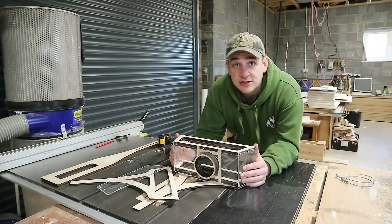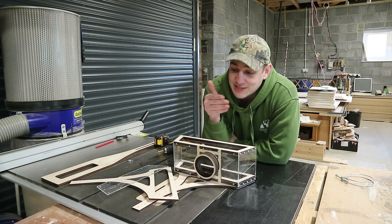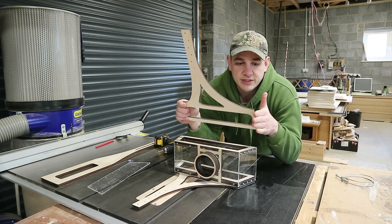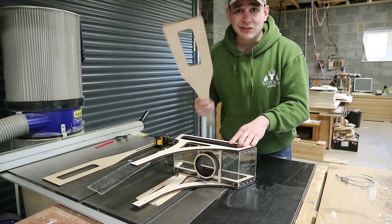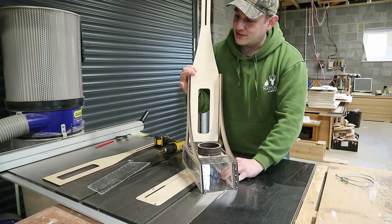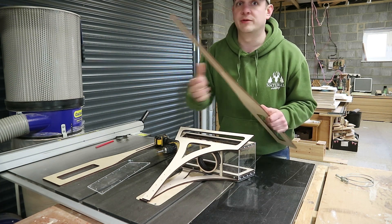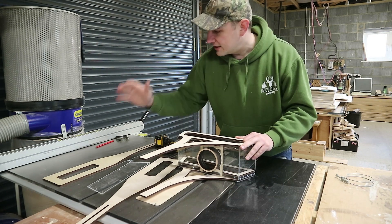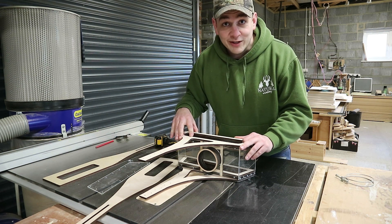I needed a way to hang it up from the boom arm. I had an original idea in my head and it didn't work — well, as I went through the process I realised it wasn't going to work. So this is the new idea: this is going to be the front end of the dust extraction and this is going to be the back end. It's going to sit on here like this, the hose is going to come up. We're going to have — it looks a little bit like a paddle but it's not. It's going to sit like this, with a bit of timber sandwiched in here, some cutouts, and a butterfly nut, washer, and bolt coming through. That way we can tighten it up, raise and lower it. So I'm going to get the acrylic on, get the pine out, make the frame up, attach the frame, and get it on the boom arm.